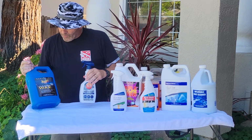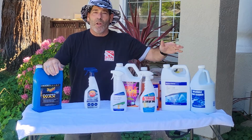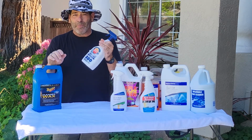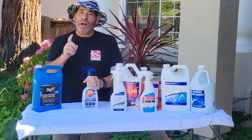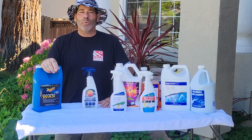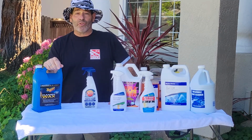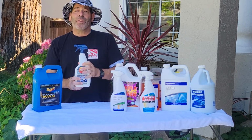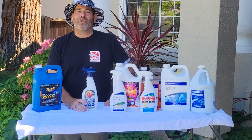All right, for cleaning the boat, what do you do after you've used the NRS inflatable boat cleaner? Well, you're going to have that dull, flat look on your Hypalon or your PVC type of material on your boat. 303 protectant has got to be the best stuff. Now listen, do not under any circumstance ever use Armor All or an Armor All type product. You will basically kind of ruin your boat from being able to patch it in the future or do some other things. Never use Armor All product. Use specifically this product. 303 is the best protectant out there. It'll make your boat shine, make it look brand new, and it gives it some protective coat.